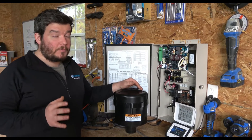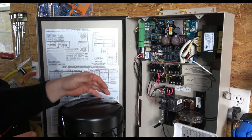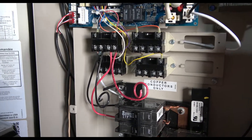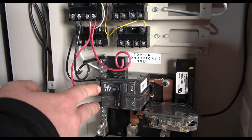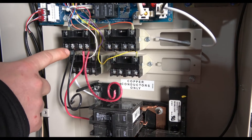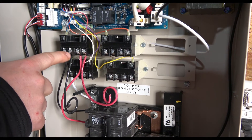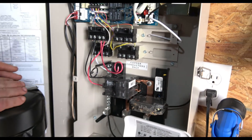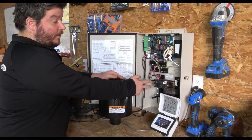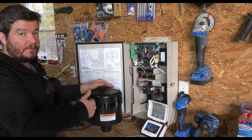To reiterate: the high voltage relays are made for things like single speed pumps, spa blowers, and lights. In that case, you tie the high voltage supply to positions two and six, and then the load side going back to your equipment — whether a single speed pump or blower — goes out at four and eight. If you have an item like a variable speed pump, gas heater, or heat pump, you tie the high voltage directly to the circuit breaker, not to the high voltage relays. Those devices turn on and off via communication cables.